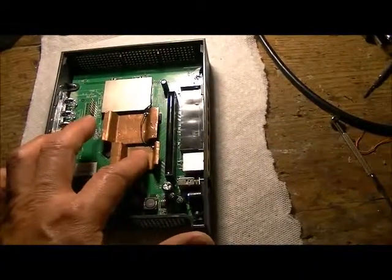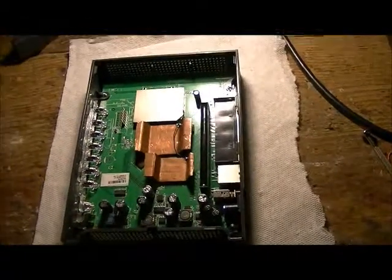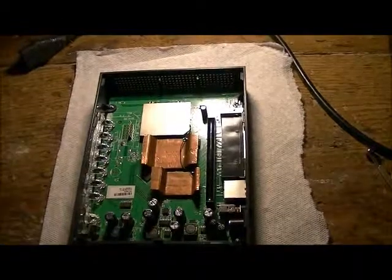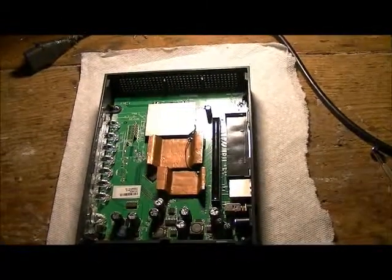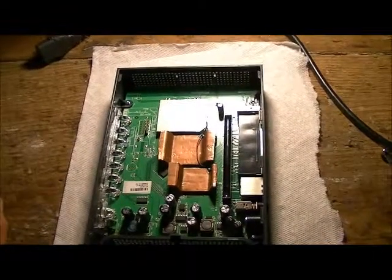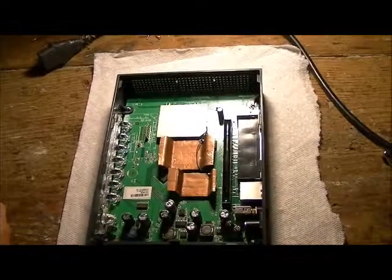This one is not quite as bad but it still also gets hot, and I believe this is probably the reason for the stability problem — the thing degraded to a certain degree. So I went out and purchased a refurbished identical unit, and I even put a slightly bigger heat sink on it.